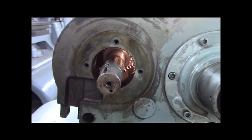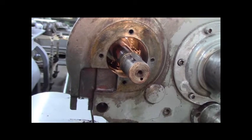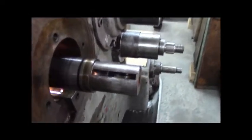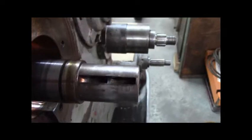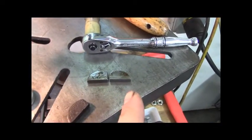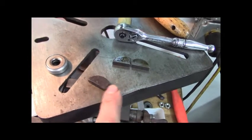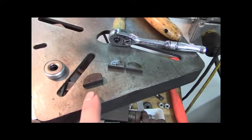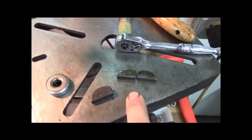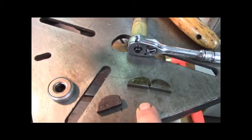It's two bronze bushings, and that's the input shaft. At first I thought it was sort of a cheap way out, but it's engineered really well. Interesting side note — there are two Woodruff keys that go in there side by side. This one was down in between the brake shoes, almost like it's been there forever, all greasy and nasty. Somebody must have dropped that in behind one of the brake shoes. It's two Woodruff keys with the corners knocked off for clearance — never seen that before.